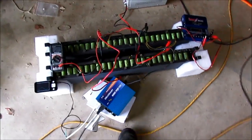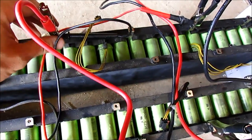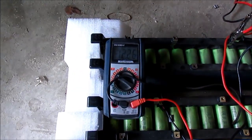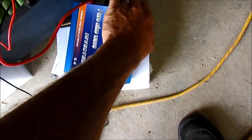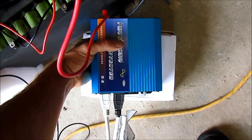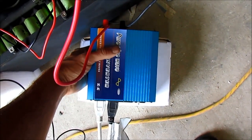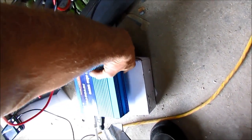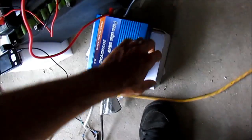I'm doing this discharge test on this bank — the clamps are warm, sitting at 12.26 volts. I'm running max load on this inverter. It's not getting warm at the back. The bottom has some MOSFETs and stuff mounted, and even there it's not really getting warm. I'm actually very impressed with this inverter. They shipped from the states.